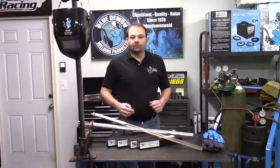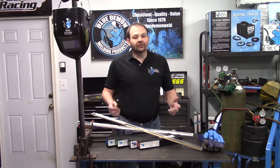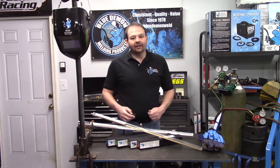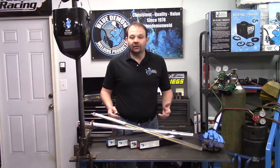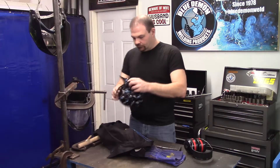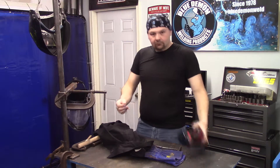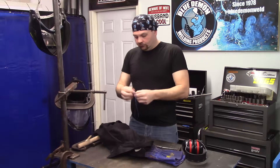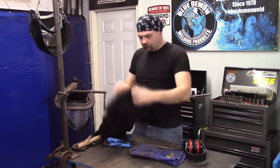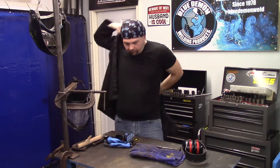Let's stop here for just a moment before we begin the demonstration. We need to talk about safety. To cover this topic thoroughly would take several videos — we don't have time for that today, but I felt some discussion on safety was needed. Gas welding and brazing bring their own dangers and concerns when compared to arc welding. When gas welding or brazing you should wear proper clothing and safety gear. This includes but is certainly not limited to safety glasses or goggles, a face shield or some combination of those, with a shade 4 or 5 lens minimum.